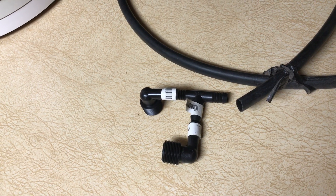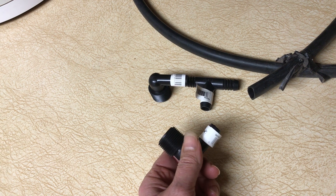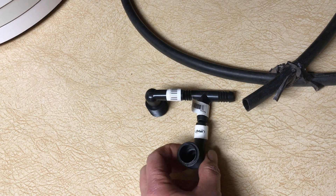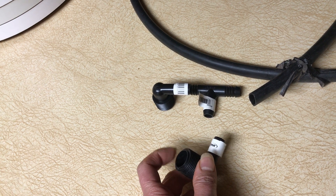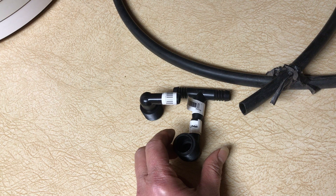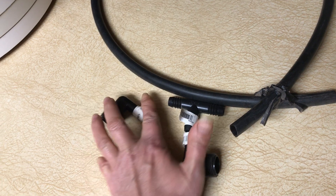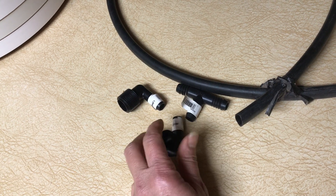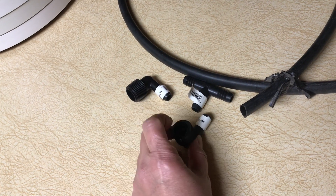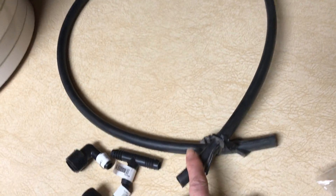I push this on, but you've got to make sure you have the right piece — the right elbow for your sprinkler head. If you're going to use a larger sprinkler head you probably want a threaded three-quarter inch; if you're going to use a smaller sprinkler head you're going to want a half-inch elbow. The two and four inch pop-up sprinklers are usually half inch. Make sure you've got the right part and push it on, because it's really hard to take off once it's on.